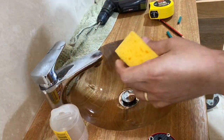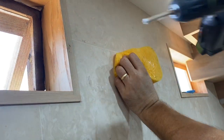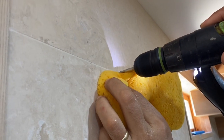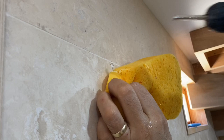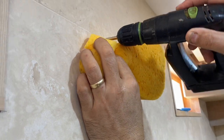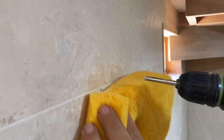If I continue to drill, the bit will get quite hot, which is not good for it. So I'm using a sponge that I've just wet to catch the dust and keep the bit cool. I'm just squeezing a bit of water in there as I drill.